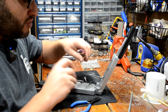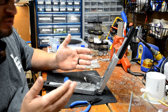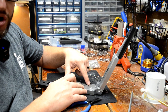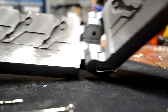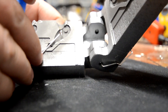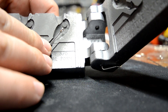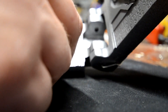These are a little sloppy, so if you put a wire form in with a hook and try to set it in the mold, it's damn near impossible to close the mold and get everything lined up. What I do is put the hook where the hook eye is going to be in the fattest part of the body. You put the hook in the cavity where it's supposed to go, but put the hook eye up in the middle of the body so it's right where you want it to be — in the fattest part of the lead. Then take some blue painter's tape and tape that hook right into place.